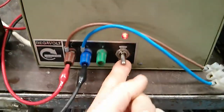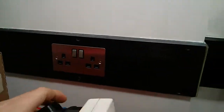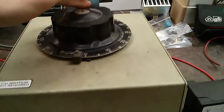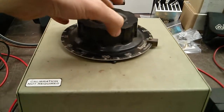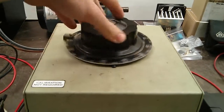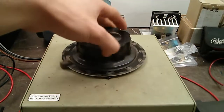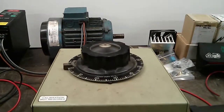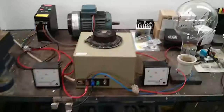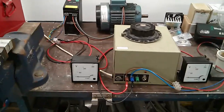One thing I would note — if I power it off and unplug it, safety first — the top knob is slightly loose, goes a little bit further than it should, and when I run it back it stops short of zero. It seems to be sliding on the shaft inside. I've already tried tightening it but it's still sliding, so it's probably got some grease where it shouldn't be — likely just a matter of degreasing that to stop it.